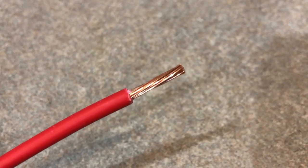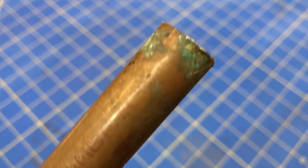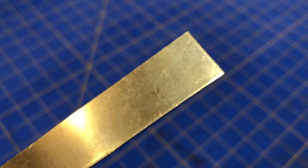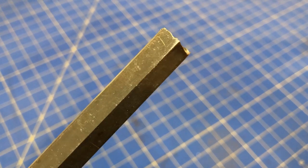Here's an example. This is a bit of multi-stranded wire — nice and shiny, this will solder great. Here's some copper pipe; it's dirty and heavily oxidized, it will need to be sanded to get down to the clean metal so it looks like this. This is a strip of brass; it will solder great with the correct solder and flux and the correct heat applied. This is some heavily oxidized brass rod; it will not solder without first being cleaned up like the copper pipe.